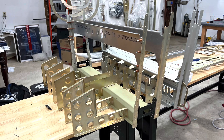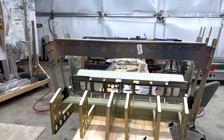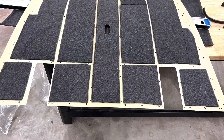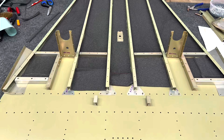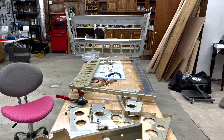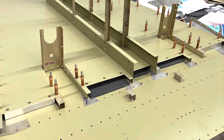This week I worked on the center fuselage. You can see here is the main spar carry-through and the rear spar carry-through. The center fuselage also has a double floor and you insulate both sides of it. I've got all these channels in place and some reinforcing plates. This was pretty rewarding — it went together pretty fast, maybe a day to a day and a half.